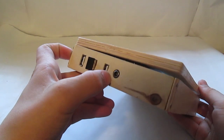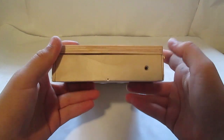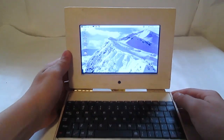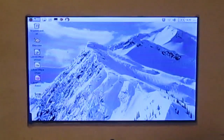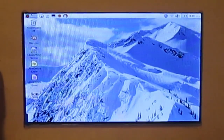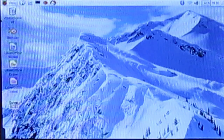You have to add a mouse because I don't have a touch pad on it. On the right side there is a 3.5 millimeter headphone jack. On the top half is a 7 inch 800 by 480 pixel display, so it's pretty good quality. On the bottom half there is a 7 inch by 2 inch keyboard that is meant for an Android tablet, but I just cut it out of the case and installed it. It's USB so it just plugs straight into the Pi, so that was pretty good — that's why I got it obviously.